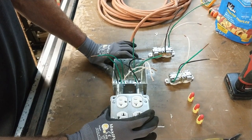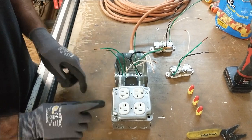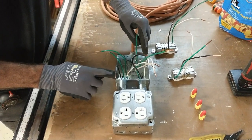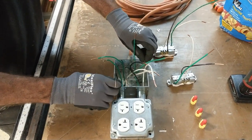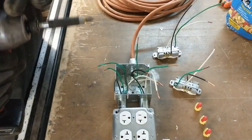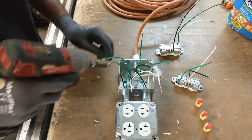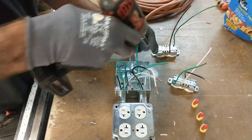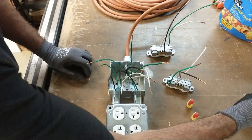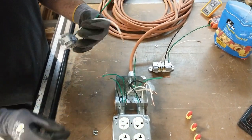So we've finished this box — the plate is mounted with two Phillips screws. On the next box, take those screws out with your drill or flat screwdriver and set them aside. Now we're going to take our devices with the pigtails on them.